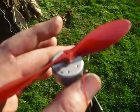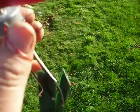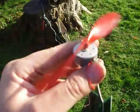and that would operate a much more powerful motor which just drives directly off the main solar panel. Still doesn't need to be that big. That's actually the more efficient way of doing it. And so you have a solar panel tracker. I'll put some gearing on that later.